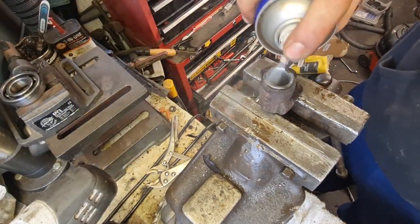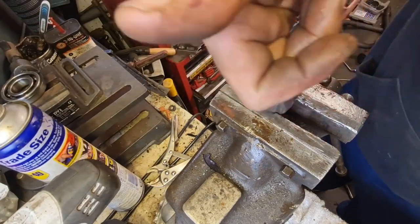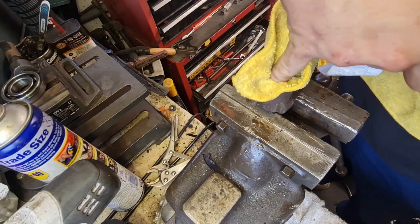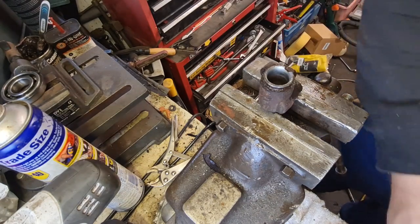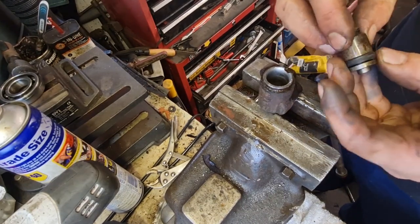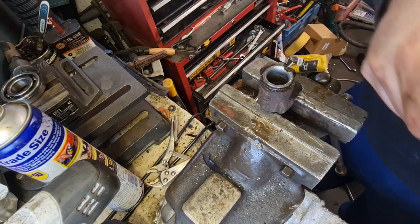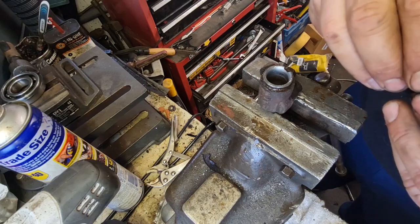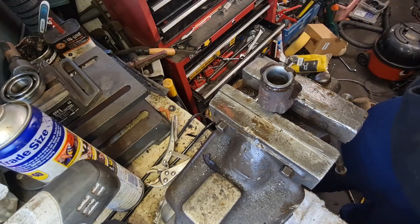As you would have seen, I've also used a wire brush on there because the hone wasn't quite getting to where it needed to go. That is looking pretty smooth inside there now, so I think we may have saved it. There's a little chunk out of the lip, but all that's for is for the rubber seal to click over, so that shouldn't be an issue. The seal is still nice and flexible, though it's got a few little nicks in it - let me go and see if I've got a better rubber seal.